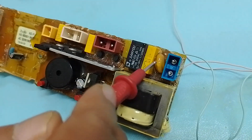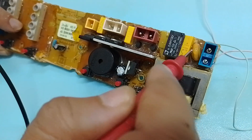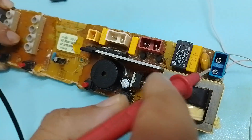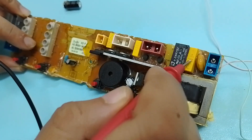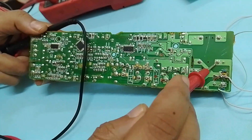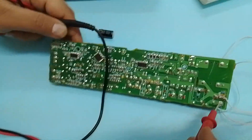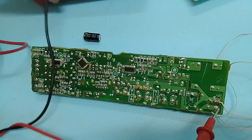After the mains input there is some sort of protection circuit that triggers in the case of high voltage. Here we have the filter capacitor, and then the 220 volts reaches across the transformer. Here we have the step-down transformer which converts 220 volts to 13 volts. So first we have to check whether we are getting the main source here or not.